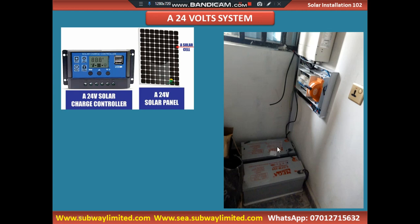We are having 2 batteries here. If you can see, we are connecting it in series. This is the positive terminal of this particular battery, and we link it to the negative terminal of this other battery. And when you connect it like that, it gives you a potential difference of 24. And we use it with this 24-volt system.